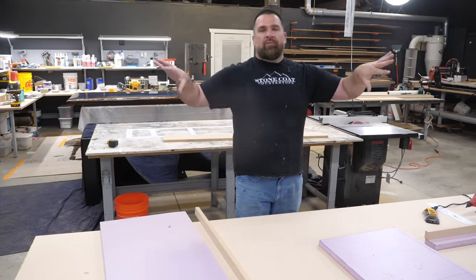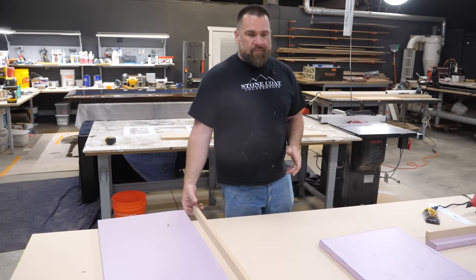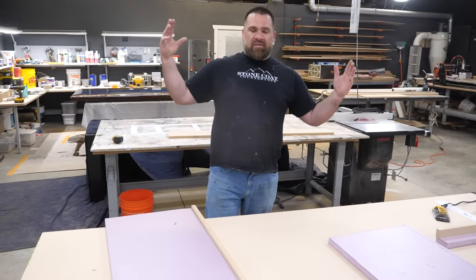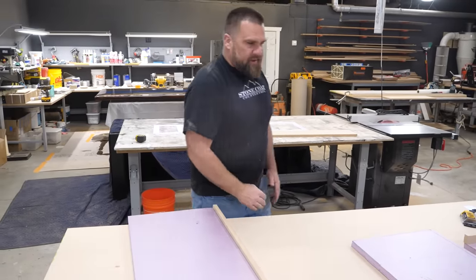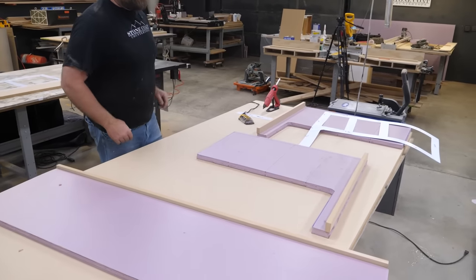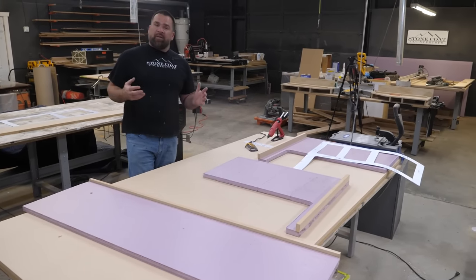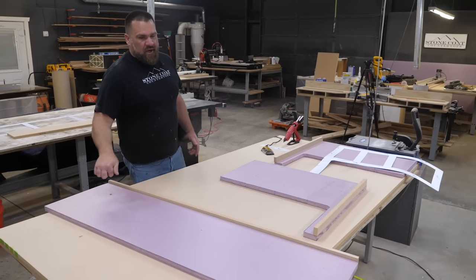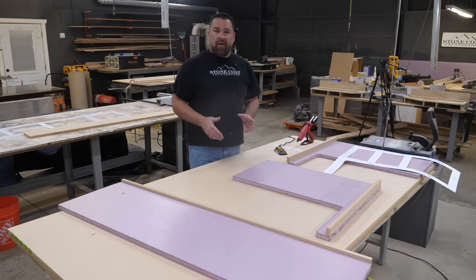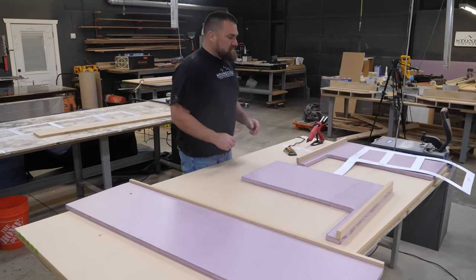Now I'd have to completely waterproof the whole tub surround again, so I'm avoiding that step. Those panels are already waterproof — they're just hideous and starting to yellow. So we're putting new waterproof panels to cover them and bring them up to date. We're making waterproof mini countertops; the wood is on the outside and the water is down here. The main surface taking water impact will be foam — it'll be impervious to water, covered in epoxy.